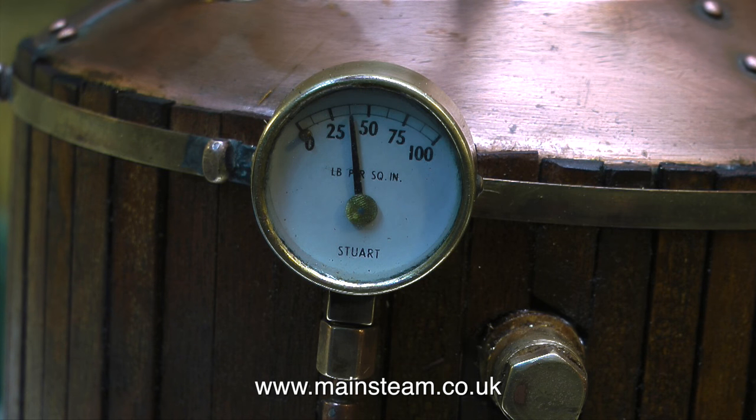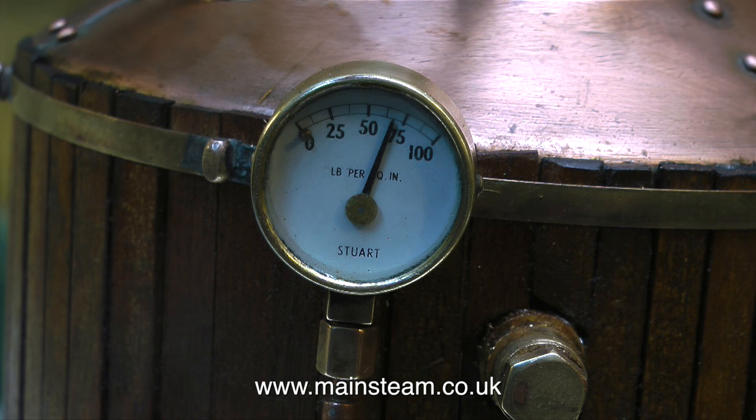There's something strange about boilers — they're almost like a living thing. It's making a breathing sound at the moment; that's actually the safety valve, and I've never figured out why they do this, but it's such an interesting sound. The pressure gauge is now at 50 pounds per square inch and rising. I would ideally like this boiler to blow off at 75 to 80 PSI — certainly no more than that, and certainly no less. But when the safety valve lifts, it needs to shut down and drop it to about 70 PSI, not down to 25. This safety valve is a homemade type; it's not a proprietary one. I would generally use commercial safety valves because they tend to pop at the right pressure and only drop the boiler pressure a slight amount before closing again — well, some of the time. And there it goes again; all the pressure has been dissipated, dropping below 50.